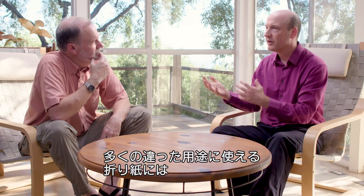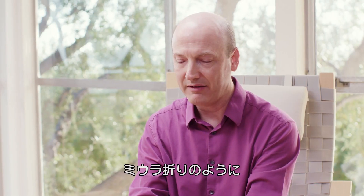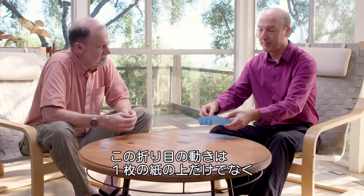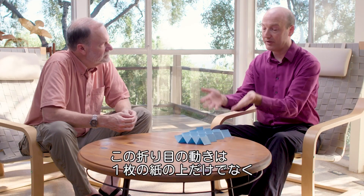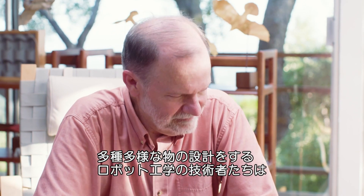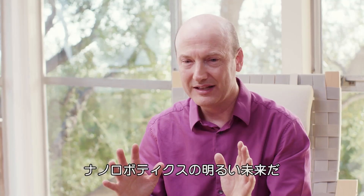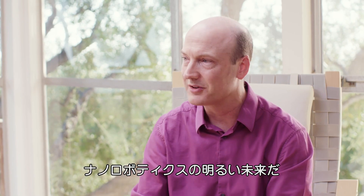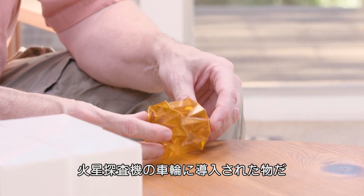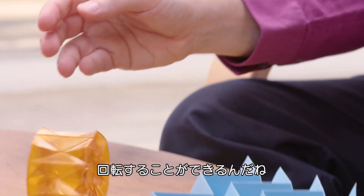Another aspect of origami mechanisms that has lent itself to many uses is that it's scalable. When you have an origami crease pattern — like the Miura-ori used in solar panel deployment — the type of motion you see will happen whether this is on a small piece of paper or on a larger scale or even a much smaller scale. Engineers, in particular robotics engineers, are turning to origami to design mechanisms that will be really big or really really small. This looks like the most promising way of getting nanorobotics to work. And this particular implementation is used to make a wheel for a rover — something that can get really tiny but then get big and fat and roll.